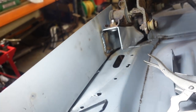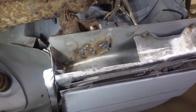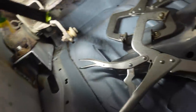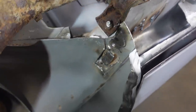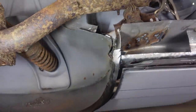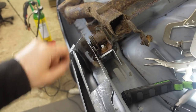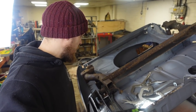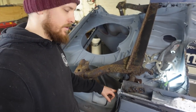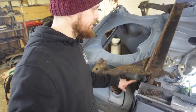And there she is — welded in. I've seam welded it at the front, there's good penetration on that, and around here we've got all these blobs of weld. I turned the welder right up because this bracket is quite thick, turned the wire speed up, and checked that we've got penetration at the back as well. I've also welded it at the back here — you can see weld coming through there. It's nice and strong; I'm pulling and pushing it and it isn't going anywhere. Measured it again and it measures exactly the same, so it hasn't moved.